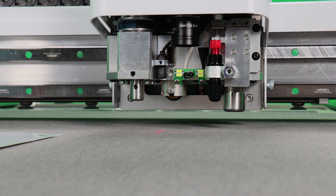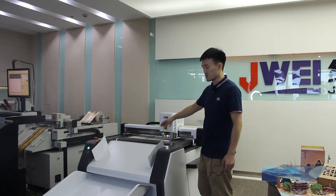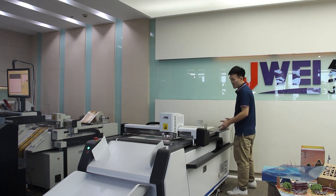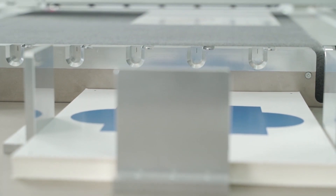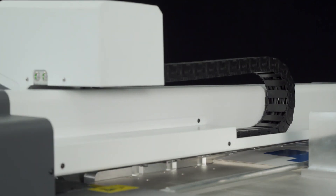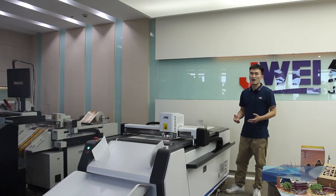There are several kinds of cutting tools: a fore-cut tool, a creasing wheel tool, and a place for the oscillation cutting tool. The max cutting thickness is up to 6 millimeters. This machine is equipped with an industrial CCD camera system. The back feeding device has a max loading thickness of 100 millimeters, with a spring string to flatten the material in case it turns up after lamination.